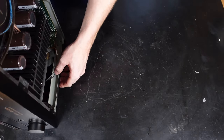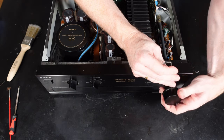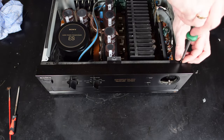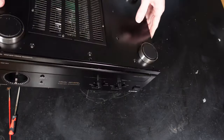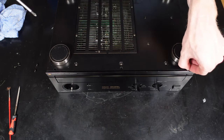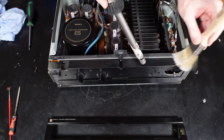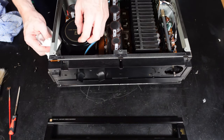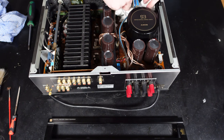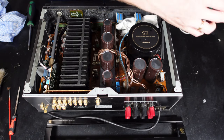Now that the underside jobs are completed I can turn it back over to continue the work from above. I'm now going to remove the front fascia panel, which is done by removing the three upper and three lower securing screws. And that's the front panel removed — the panel behind can now also be cleaned. The next thing to do is to spray some deoxit into the back of the control pots and mechanisms to help clean and lubricate them. I'm just putting some tissue underneath them before I do this to prevent fluid going everywhere. I'm using the green label deoxit for this. Once sprayed into the back of the controls I'm working the knobs to get the deoxit all around inside.